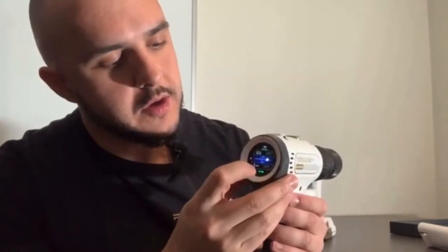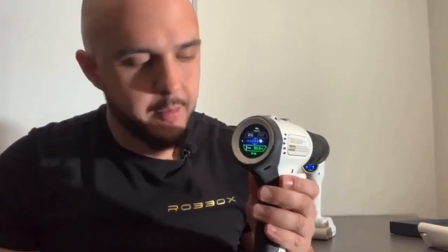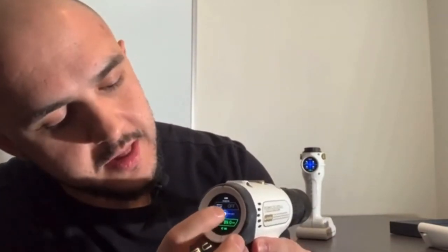Simultaneously, you also have the bottom laser. You go in here, click that, and you're going to see a value moving up and down — this is the bottom laser right here. It's measuring from the bottom to the center of the drill. This gives you height, so now you know if you're actually drilling at the same height all the way through when performing a specific task. What's really cool is you can even see the level in the background. You click it again to calibrate it. So this helps you know you're doing all these measurements while also helping you hold your hands straight — basically the dummy-proof drill.